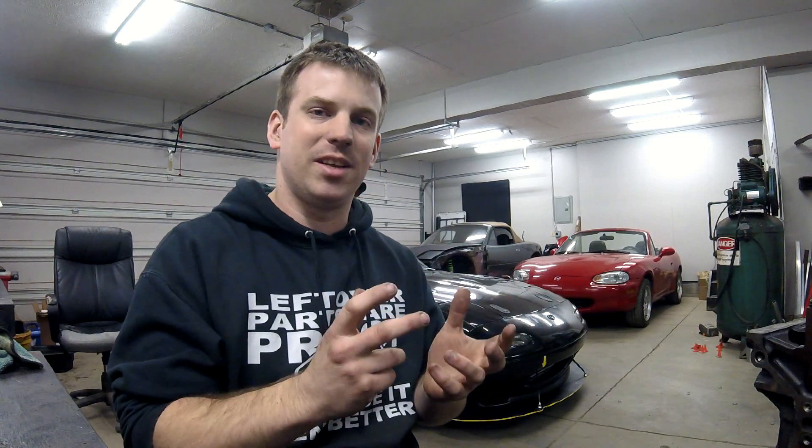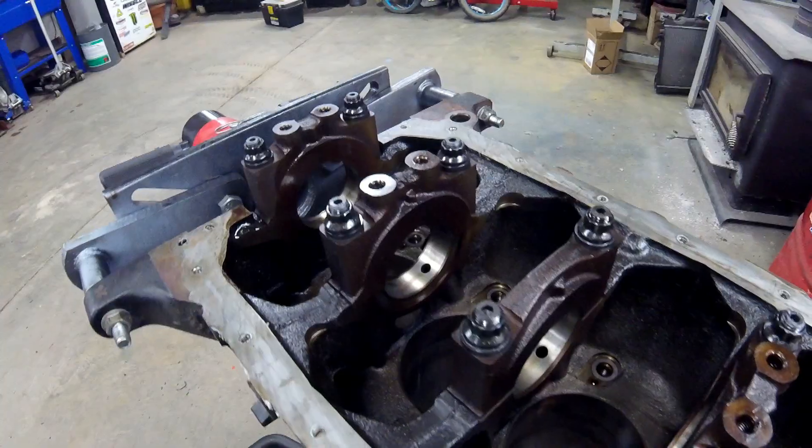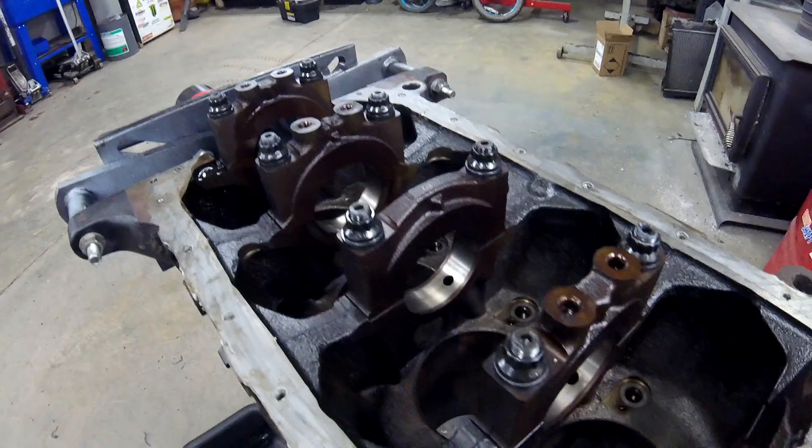So stud manufacturers often supply a lubricant they want you to put on the threads. The purpose is that you get the same amount of resistance they had when designing the part, ensuring your clamping force is exactly what they intended. Read the instructions — sometimes they say to install dry, sometimes they say to use oil. ARP usually comes with a packet of grease for installation. It's very important that if you want an accurate clamping force, you install the part the way it was designed to be installed. Thanks for watching — we'll catch you next time.